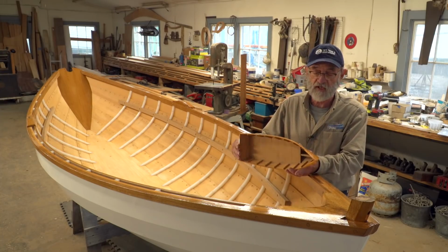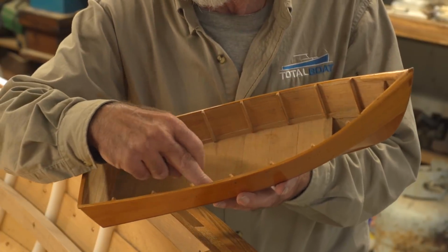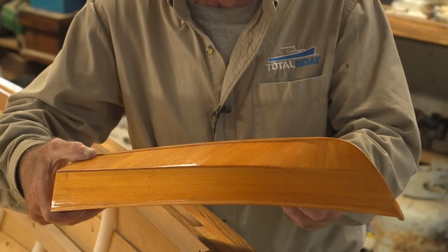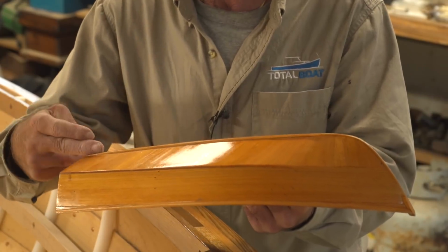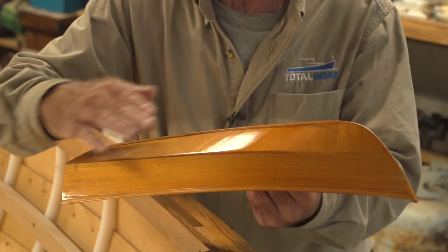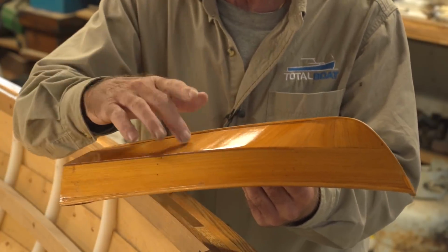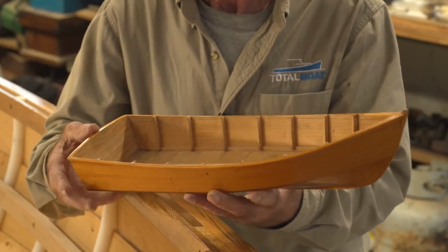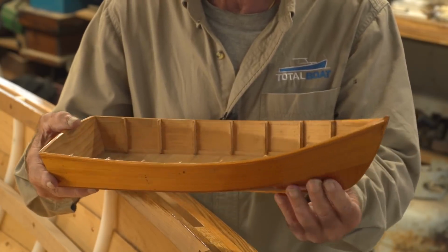It's a cross-planked V-bottom skiff. It's got a cross-plank sole from chine to chine that's done upside down like this, just like a skiff is built, like a flat bottom skiff, planked right straight across. And then there's a keel added on the very bottom of the flat bottom, and then it's planked to a V over that keel. It's going to be quite different. The bottom will be made of 2 layers of wood itself, and the sole is going to be 1 layer. But, you know, it's very much like a skiff, except it's going to be V-bottom.